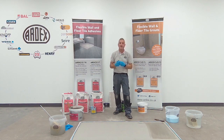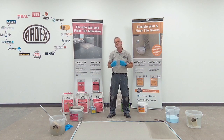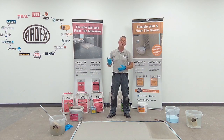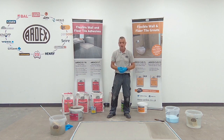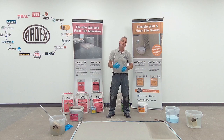While we're on the subject of mixing, this is another element to consider, something we don't always think about in day-to-day tiling life. In hotter temperatures, there are things you need to consider, and one is the water supply. Just for this demonstration here, I got some water in the ARDEX Academy, and I had to run off 2 buckets of water before it even got cold. So, when you are using cold water, don't presume, because you're using a cold tap, that cold water is coming out. You will have to run off some of the water first before you start using it to mix up the products. Also, if the site conditions mean you may not have a water supply very close by, you may be using water butts, you may be using hoses.